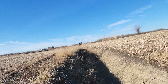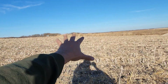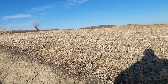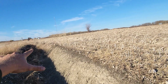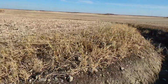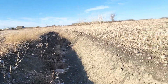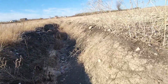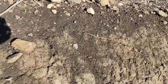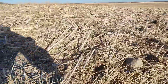So my plan is going to be to strip this back 2 or 3 widths on each side, like 25 feet out, if not more. And then I'm going to move the clay to fill it, and then I'm going to do a path the width of the blade, so 16 feet, or probably a width and a half, on grade the whole way to balance things out. Material balance wise, because I'm gonna take a foot off the top each way and bring it back to center to fill this.